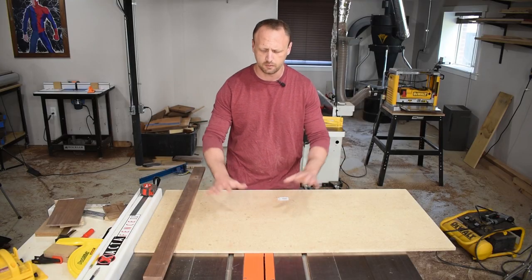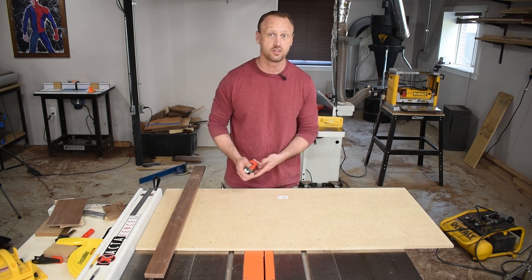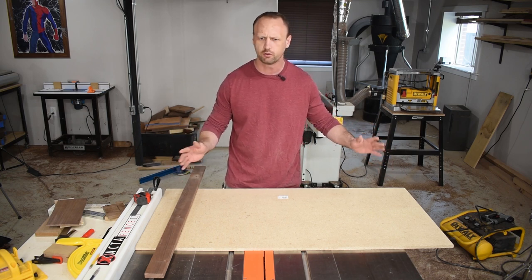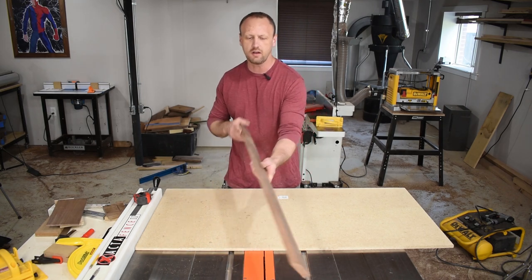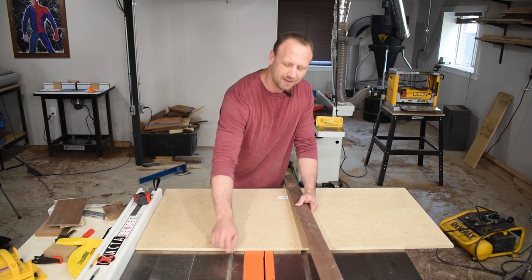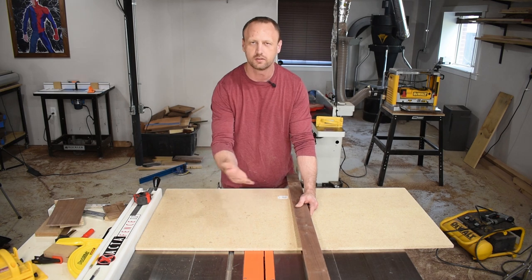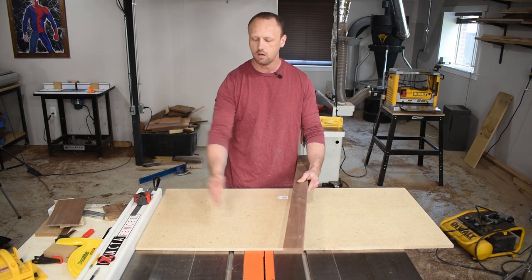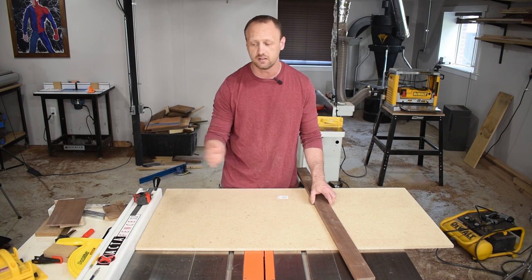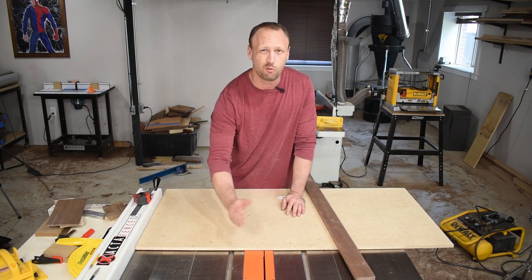I'm going to cut the bottom panel — I'll keep it the same width, which I think is 23 inches, and for length I'll do whatever the length of my fences were, which I think is around 33 or 34 inches. Then I'll work on the rails, and I'm going to plane them down until they're slightly thinner than the channel depth — I think this is about three-eighths of an inch deep. I'll test fit to make sure they're just under the surface so they're not proud. Then I'll come over to the table saw, move my fence, and rip two pieces for each channel, sneaking up on the fit until they slide perfectly into the channel with no slop.